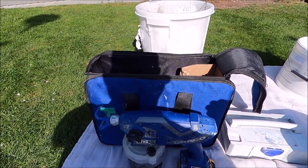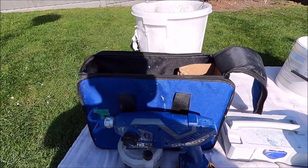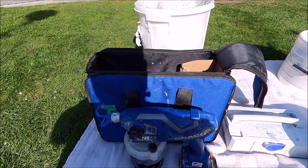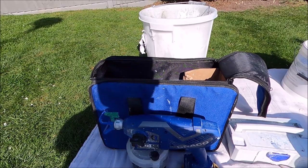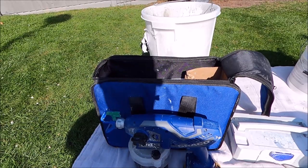It's a common thing with these — a lot of people have bought them and the pumps have been going after just a few uses. So I have a general rule of thumb: if I'm going to use this sprayer and it uses more than one battery — which is about 20 minutes run time maximum — I'm most likely using it for too long. If I'm doing a door, some coving, architrave, or a ceiling rose, this will do it in seconds. But if you're going over that 20 minutes, that battery change is a sign it's too long. That's my general rule of thumb.